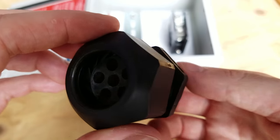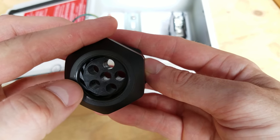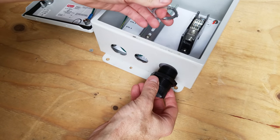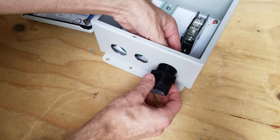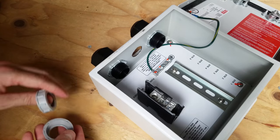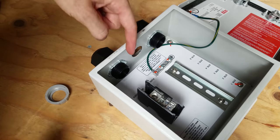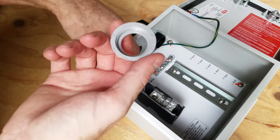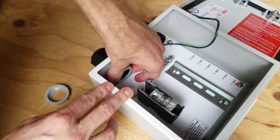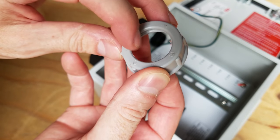Once you fish your wires through, you tighten down this nut which compresses the rubber gasket against the wires and forms a seal. I'm going to insert one of these in each hole and use a standard lock ring on the back. On the inside of the enclosure I'm also going to put these anti-short bushings — the wire is plastic so it won't short anything, but I want to make sure the wire is protected from rubbing against the edges of the fitting. The bushings have a smooth surface for the wire to sit against.